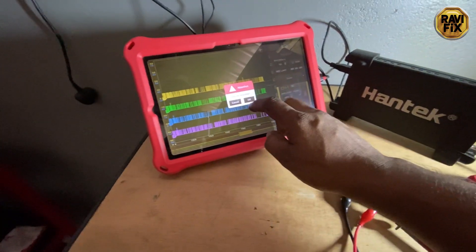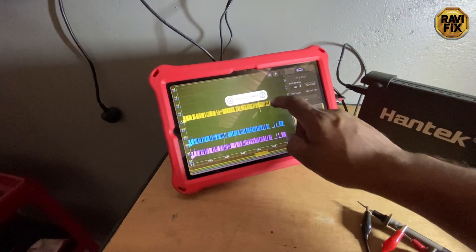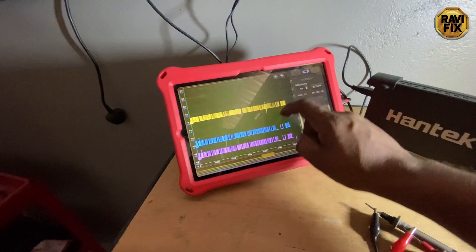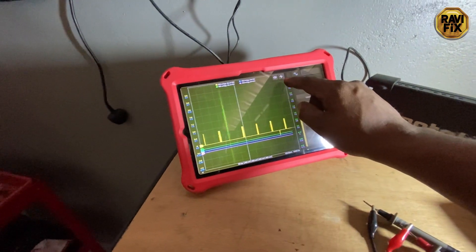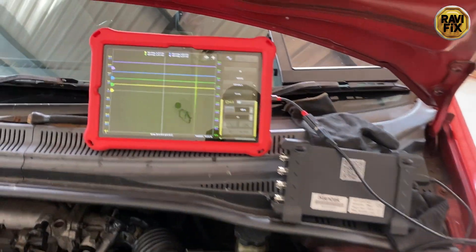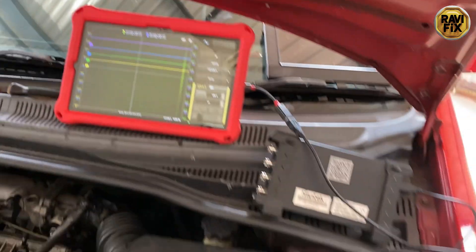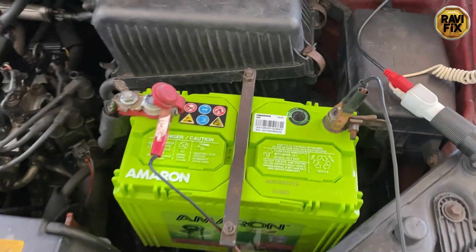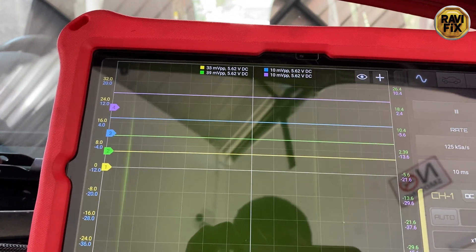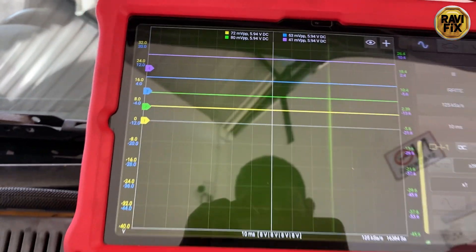So that is the reason you are seeing noise on all four channels. But if you use any other DC source to power the oscilloscope — like a power bank or something similar — there will not be any noise like that. I demonstrate this method in the car right now. You can see I have already connected the oscilloscope. Here I use the 12-volt car battery as the power source for the oscilloscope, connected through a car mobile phone charger. You can see there are no more noises compared to what I showed earlier with the wall connector, because this is a direct DC source.